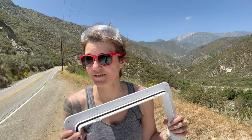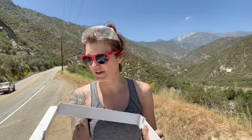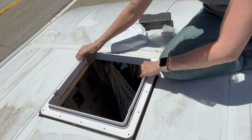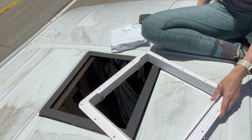I am on my roof right now — this is just amazing. It's a little bit windy, very sunny, lots of cars passing, but it's gorgeous. First thing I'm going to do is just double check and make sure this adapter thing fits. If it does, I'm going to put butyl tape around the edges. The brackets here need to be on the sides. It fits and I have a little tiny bit of wiggle room. Now I'm going to butyl tape around the edges.